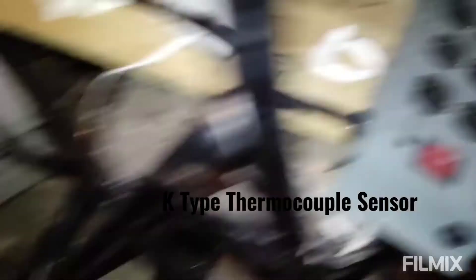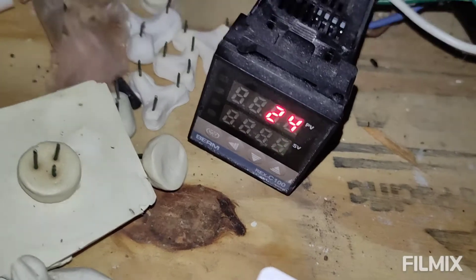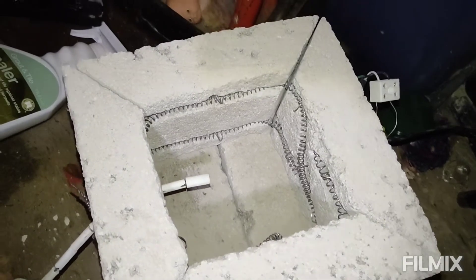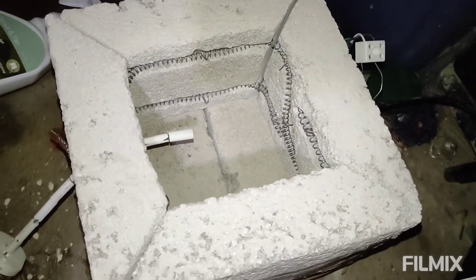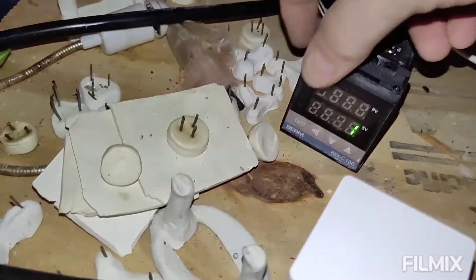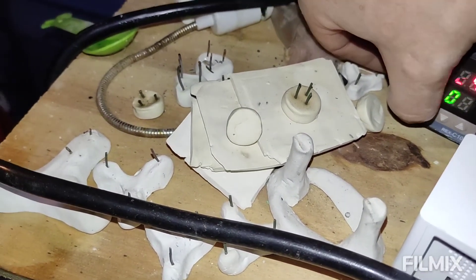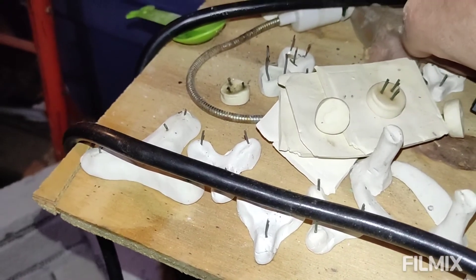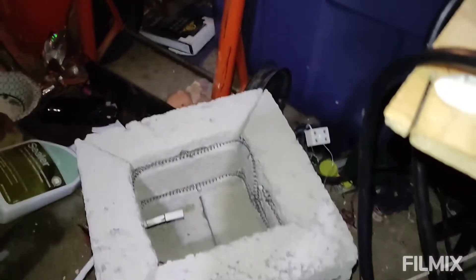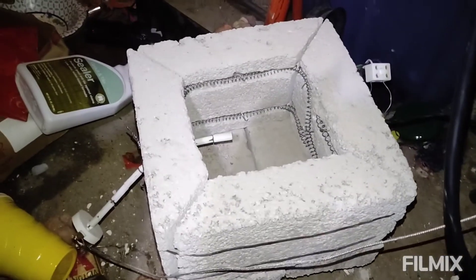I've got my little temperature sensor — a thermocouple — in there, and right now it's showing 1 degree. I've got it programmed for 24 Celsius right now. Whenever you first fire up kanthal wire, it oxidizes, so it'll smoke up the first time. Let's put it to say 50 degrees just for fun — okay, and there it goes smoking. I'm not going to breathe that in.